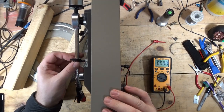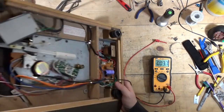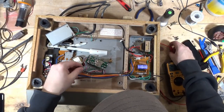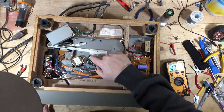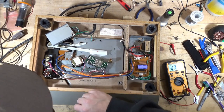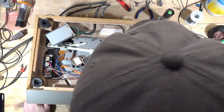And I haven't pulled down the schematic yet to see what I should have, but I'm thinking if it's a DC 12 volt motor, I should see some voltage on it, right? So what I was thinking, and what I could do, I guess, is use a 9 volt battery to test the motor out just to make sure it's spinning. It could be an issue on this board.